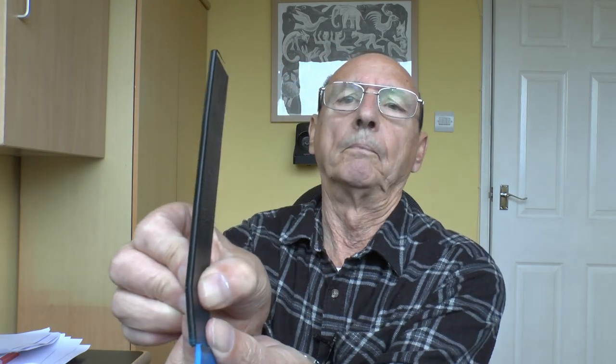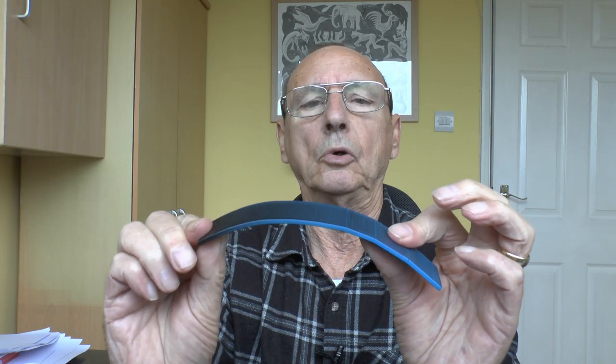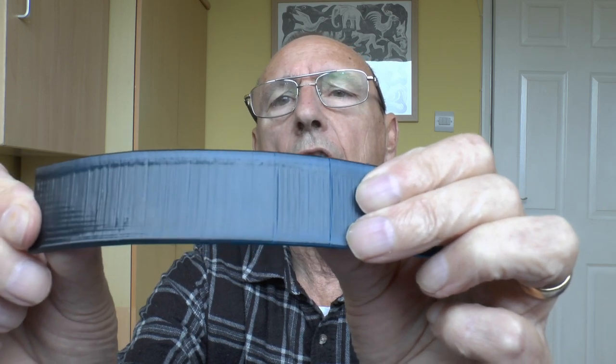So it had to be basically the mixing of the two filaments that's causing the problem. I printed that same thin part varying between 100% PLA and 100% TPU and got weak points again where it just breaks. It is variable flex — that part actually worked — but there are all sorts of lines and it's liable to break. The conclusion was that blending TPU95 with PLA just doesn't work; you get weak points and layer adhesion is just not good.